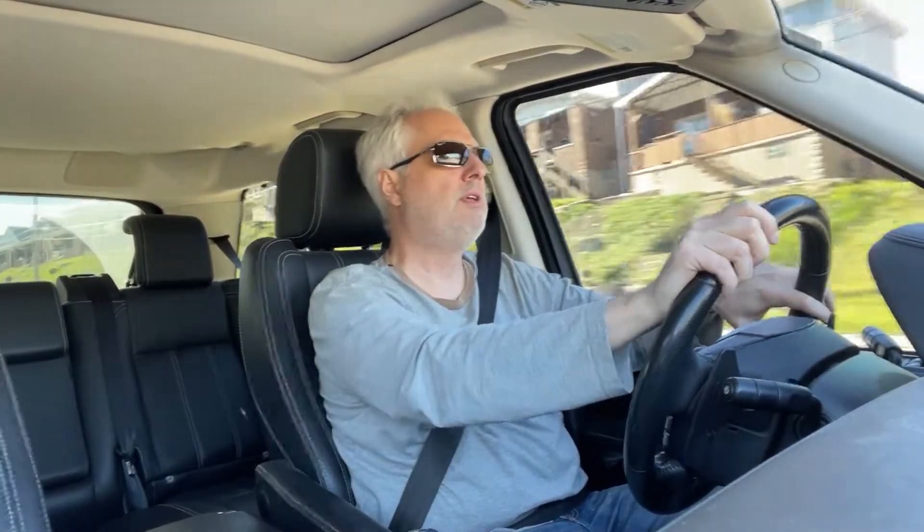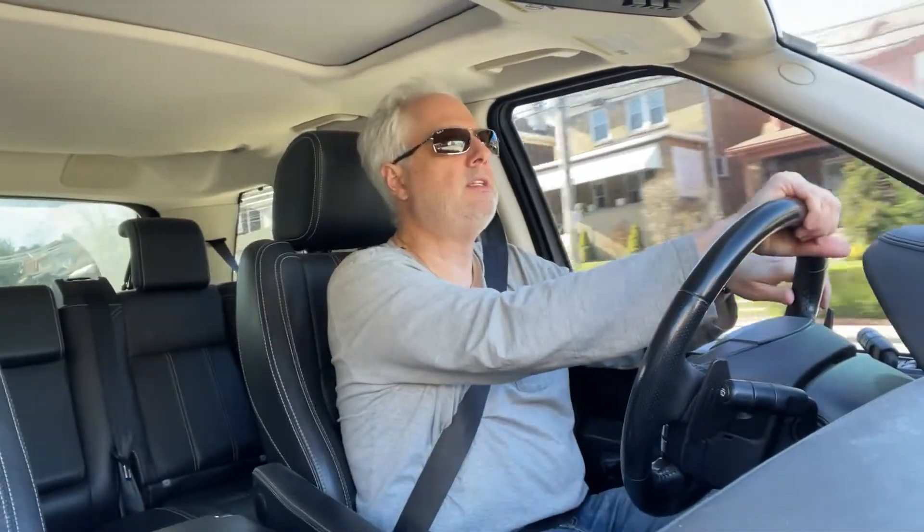This one came in looking like it wasn't working properly. I knew the seller had gotten a battery swap done on it, and I've dealt with this before. The chronograph hand was resetting at like the four o'clock position instead of 12, and the other two sub-dial totalizers were off-kilter too. That happens on a quartz chronograph when you swap in a new battery — it's a known thing. It's in the manual how to fix it, but I figured I'd add a tutorial into this video so you could have it for reference. I think the same process applies on most modules.